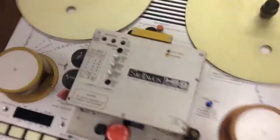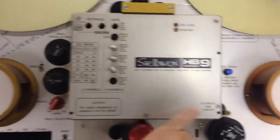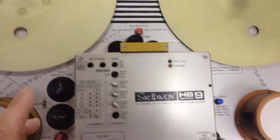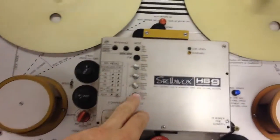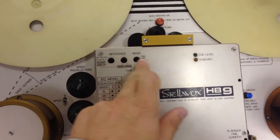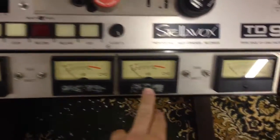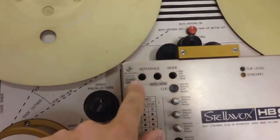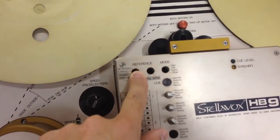All the cards are modular. Take off the head block — we've got three screws, the whole lump comes out with the cards. You can swap around and configure it the way you want. For example, this machine here is 3-track. There should be a pilot card in here, but that's missing. You can see here channel 1, channel 2, channel 3, and then we've got a Q channel, which is related to the synchronising signals.